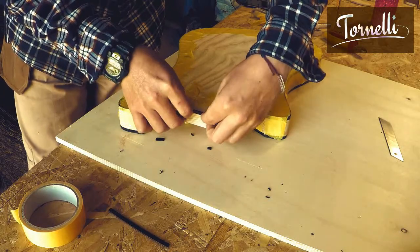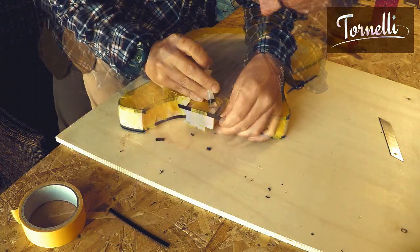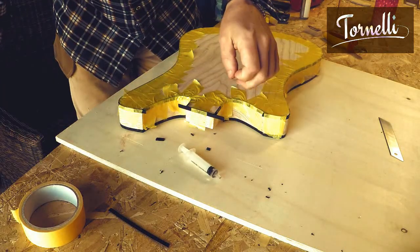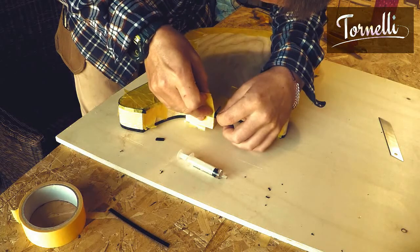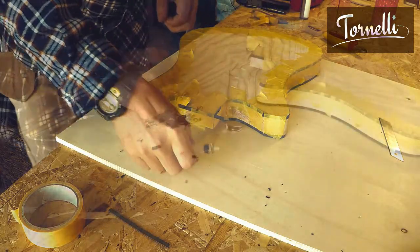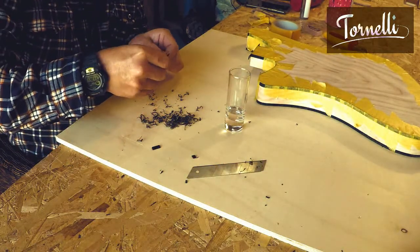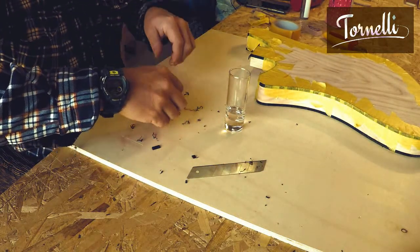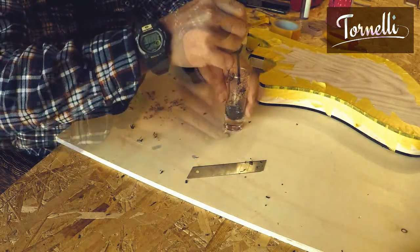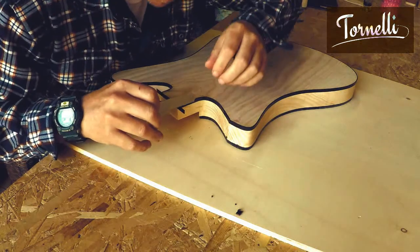When it comes to getting a perfect binding result, part of that is filling in some of the hairline cracks and gaps. It's pretty much inevitable that depending on how complex the shape of the guitar is, you're going to have some hairline gaps in the binding or at the joins. Rather than using sawdust and wood glue to fill those gaps, a really nice way is to use the binding itself as a glue and filler - just take the leftover binding, shave off a load of shavings, put them in a little bit of acetone, and leave it for a few hours.